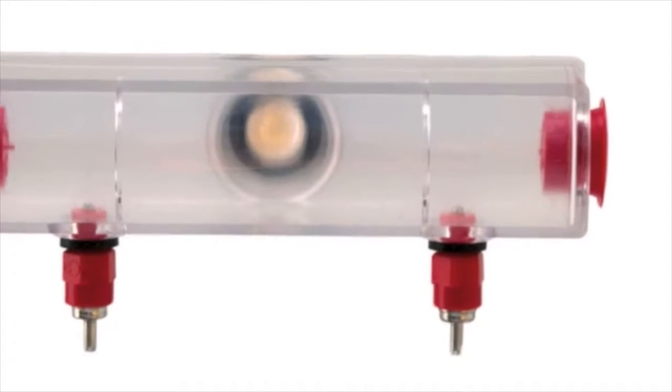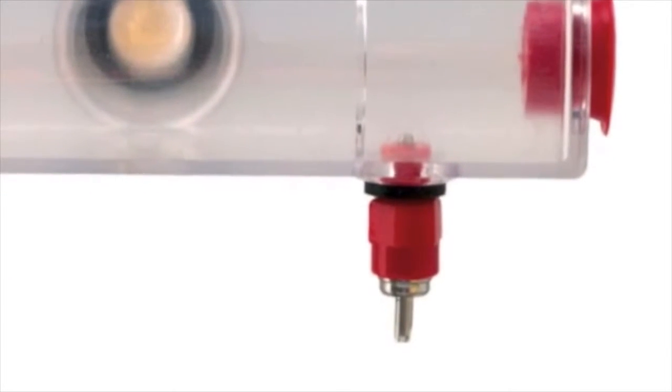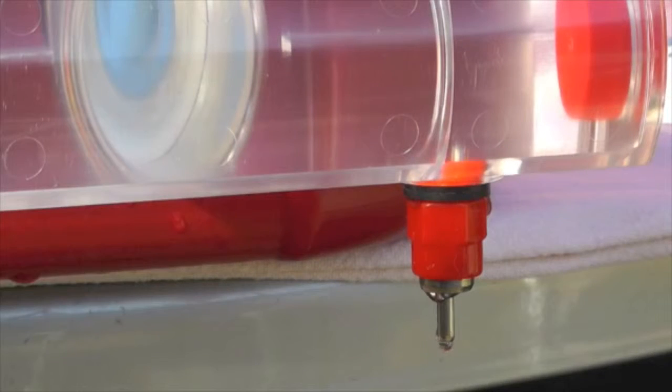A drip from the stem of the valve on your waterer every 2 to 4 minutes is fairly common, particularly in the beginning. However, if the drip is more like the one shown here, there may be a small gap between the gasket and the clear plastic of your BriteTap waterer that is allowing some water to escape. This is easily fixed with a simple adjustment.